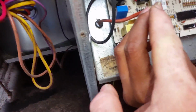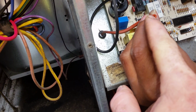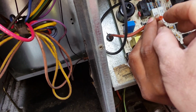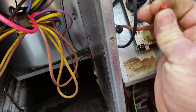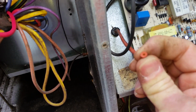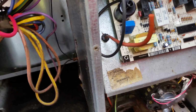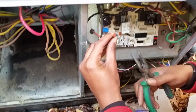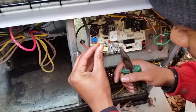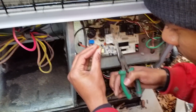Right there, this little center spark, you're gonna wanna make sure that that gets in there real good and tight, and see there's metal inside of this. And so, in fact, let's go ahead and trim that one, because we're not seeing the metal. Right there, I like to see the actual metal. So we'll cut that. Okay, so you're cutting it, and so you see a little bit of metal that's in the center. Yeah. All right, so because that one, let's cut it just a teeny bit more.